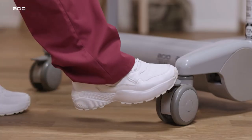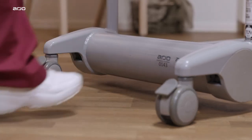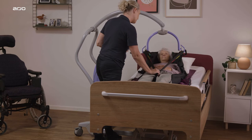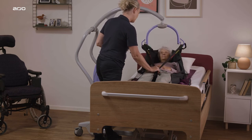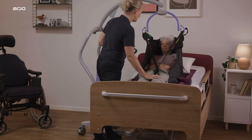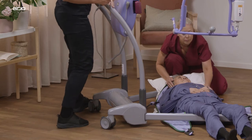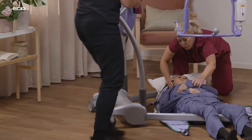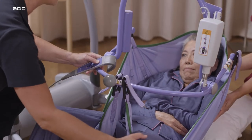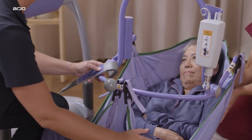The brakes on both casters have to be applied to get full effect. When lifting or lowering a patient who is supported by a sling, it is not necessary to use the brakes. This allows the lift to move to the correct position relative to the center of gravity of the patient. It is recommended to apply the brakes, however, when lifting a patient from the floor. This may prevent any unwanted or accidental movement of the Maxi Twin lift that may cause harm or injury.